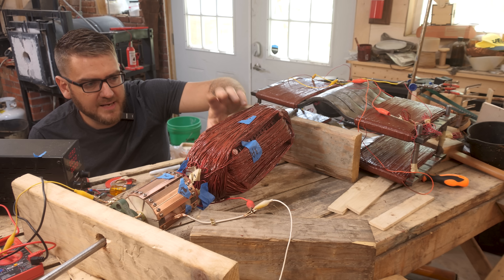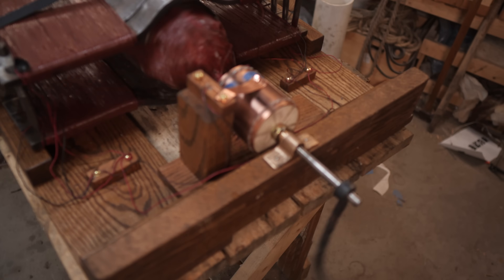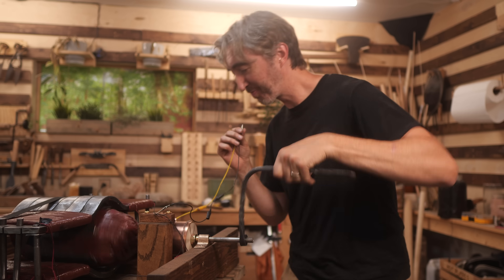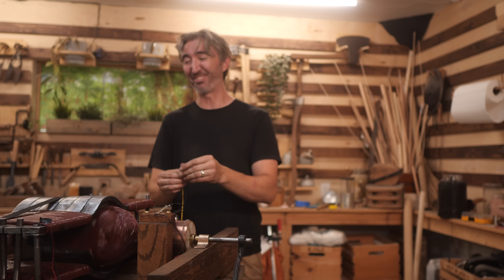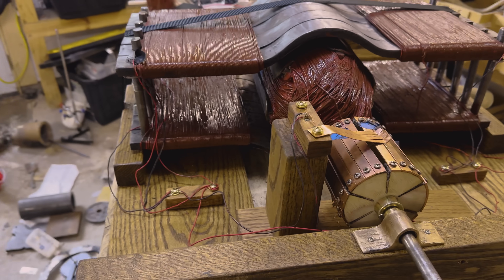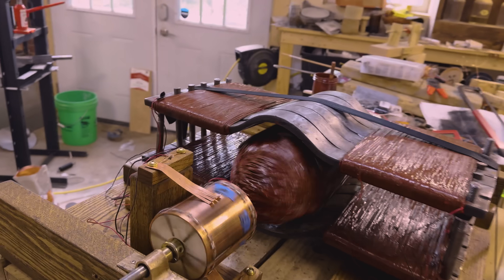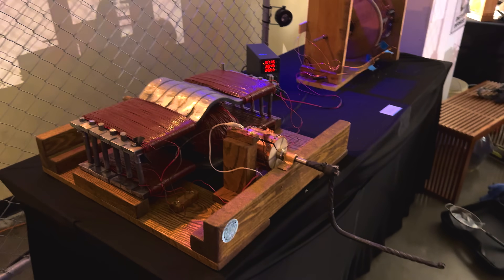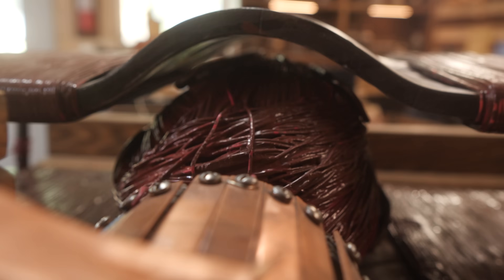I think we're very close and should hopefully start producing some power. This is what we basically ended up bringing to OpenSauce — a lot of work to bring it out there. It's over 100 pounds so I had to pack it across three different suitcases. But the end result was not very impressive. With the hand crank it can just kind of make an LED flicker on and off, which is very disappointing. The biggest problem is our rotor. One improvement was going back and adding metal T's between each coil, which made a pretty decent improvement, but it still wasn't really great enough to do much.